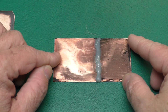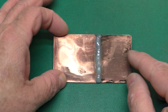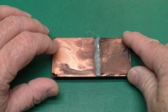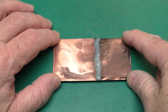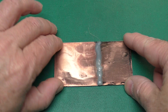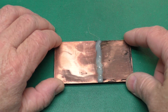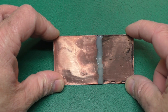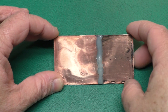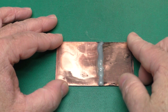The side with citric acid mixed with water at a 20% mixture worked much faster than the 20% mixture of citric acid with glycerin. I don't know exactly why chemically speaking — I'm guessing it may have something to do with the fact that water has more hydrogen in it, and it's more readily available to mix with other things. If that's something you know about, I'd love to hear a more technical explanation.